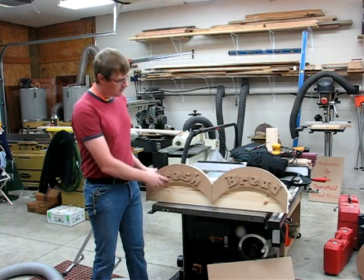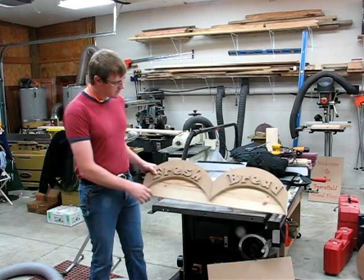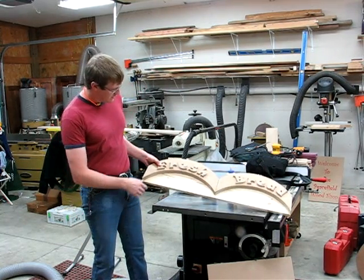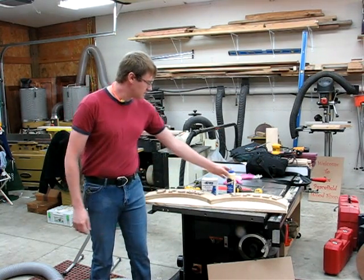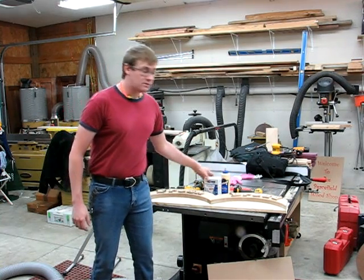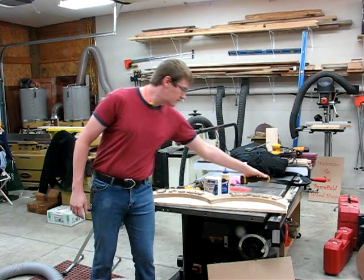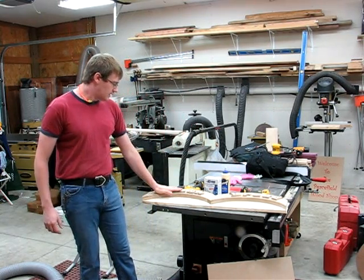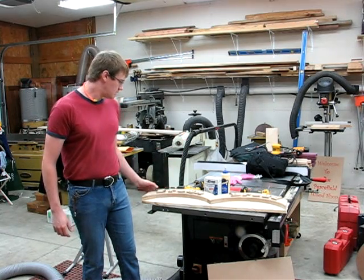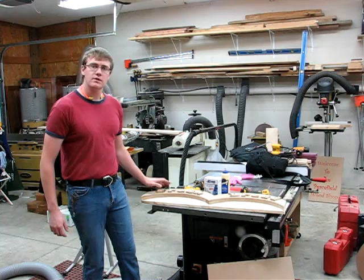Our arches here are now on what's going to be the top part of our display slash cabinet. As you can see, now there's no board behind them visible on the top. I just used some Titebond 2 here, some Kreg 1.5" screws, because that's just what I had laying around, and then my DeWalt 12-volt impact here. I just aligned them on the lines, spread some glue down, and screwed them from the underside, and now the screws will hold it until the glue dries, and we can move on to the rest of our cabinet here.